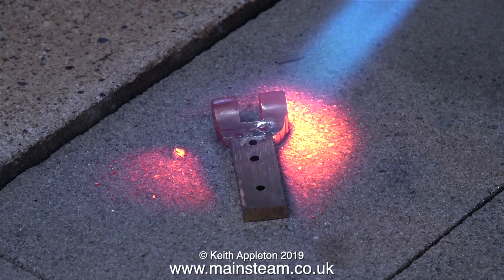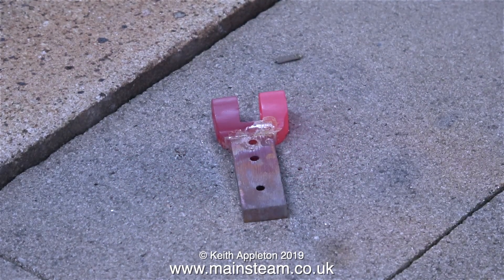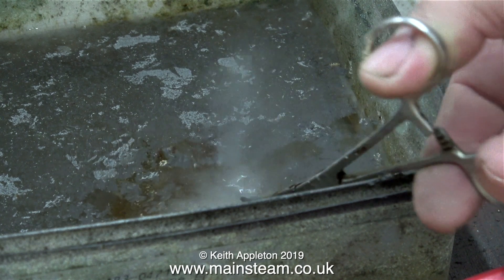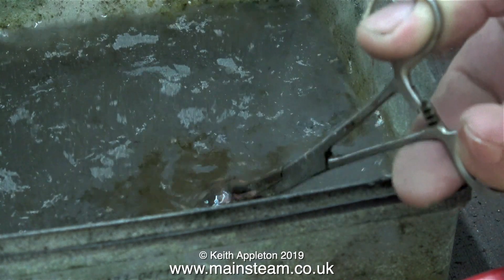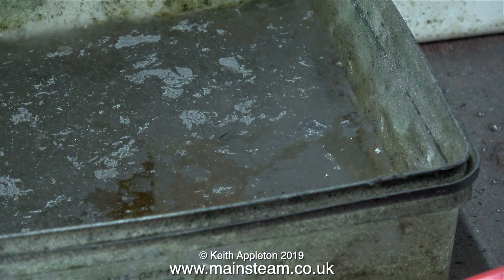It's time now to join part A to part B. I'm using my brazing hearth and my blowtorch to silver solder the two parts together. After silver soldering the part, as usual I'll let the part cool to black. And in this clip I'm quenching the part in some water. Just in case you're wondering, the skin on top of the water is some overspray because I paint near this tub of water. It has its benefits — having a skin of paint on top of the water at least it stops it evaporating.